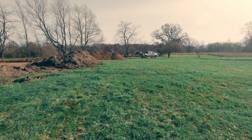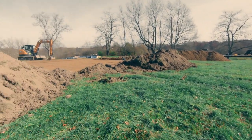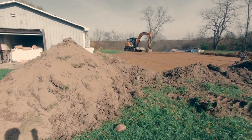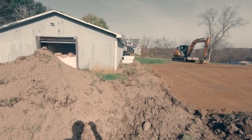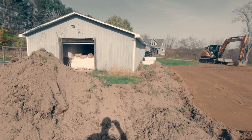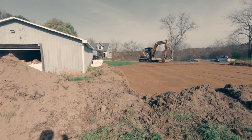We actually have four or five inches of fall going that way, so we're not looking for crazy running water — we just want to get the water away from the new barn and this barn here. Eventually we're also going to cut a little swale between the two buildings and we have to do it now because we won't have access once this thing's done. I'm going to try to get most of that water to come to the back of the building and tie into our existing swale. I'm probably going to do some sort of time lapse for you guys.